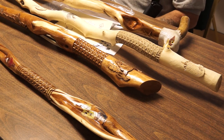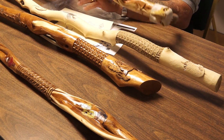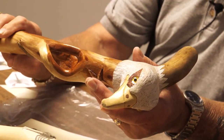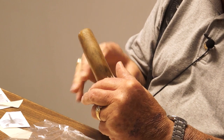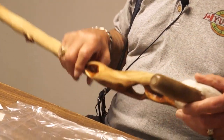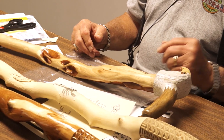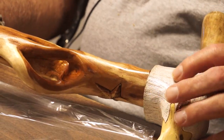Something I just found out — that round cane out there on the display table that's chip carved: I had drilled my one-inch hole so I could put the handle on it, and I put it in and it was pretty tight. When I glued it and started it on, it came within about an eighth of an inch and stopped — it compressed the air and it wouldn't go anymore. I beat on it with a hammer and it wouldn't go. So now on the two I did yesterday, I just take a knife and cut a little V on the side so the air can escape. That's something to remember — I split an eagle head once doing it too tight.